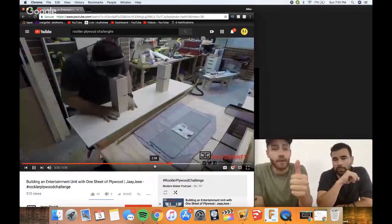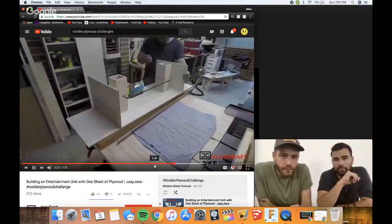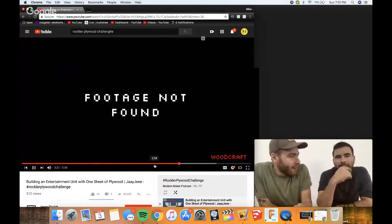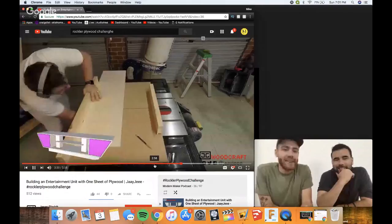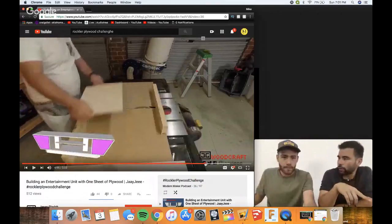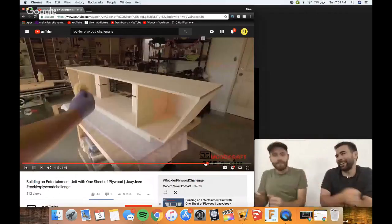Keith, what's up, brother? Now it was finally time to dry fit everything together and see how it looks. After positioning and squaring everything up, I glued everything. All that was left to do was cut the front and back doors of the side cabinets to their sizes. The backs are glued in. Up next is to sand to 240 grit before finishing with two coats of white poly.